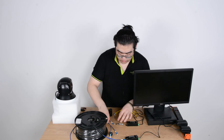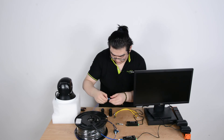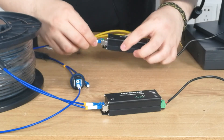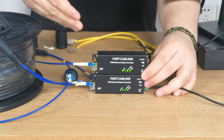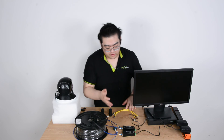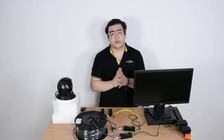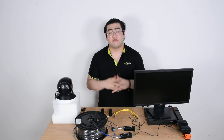Then we take the short patch cord and insert this end into another fiber SFP module going to the other media converter. You can see the indicators are on, meaning the connection is thorough — the coupler is working and we now have another meter extended. That's pretty much it for this video. If you have any questions, leave them in the comments below. Our next video will cover tips to pay attention to when setting up an extending cord for a fiber optic link. Please follow us and I'll see you next time, goodbye.